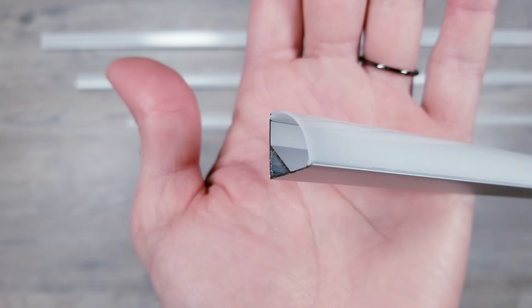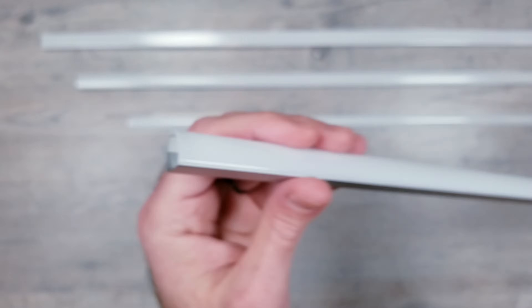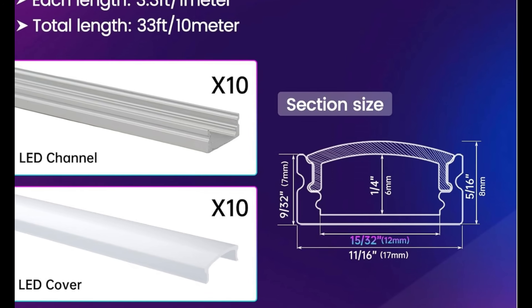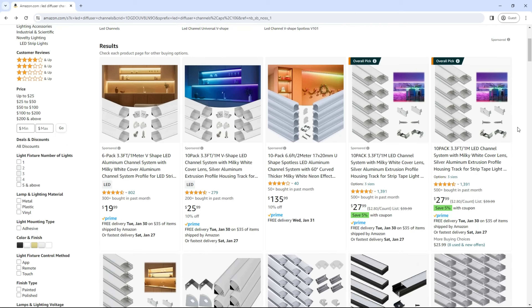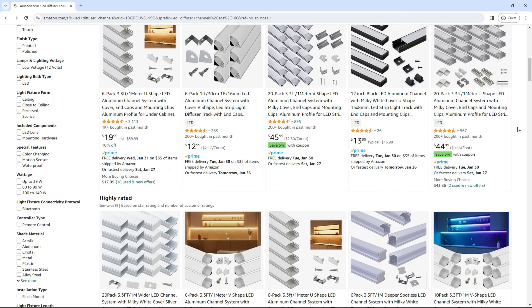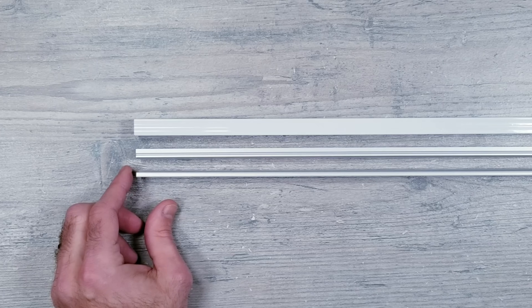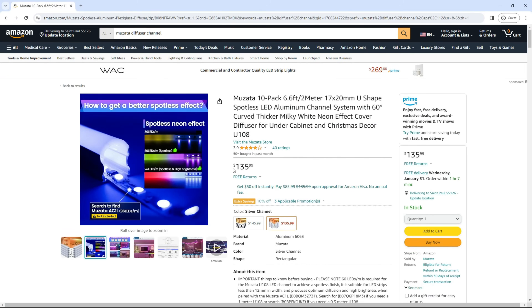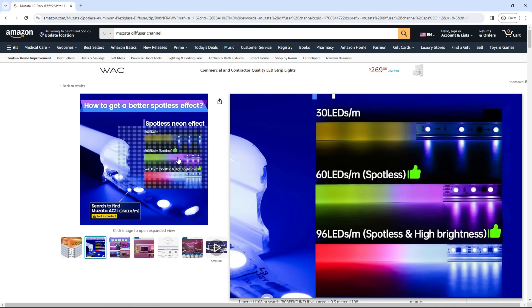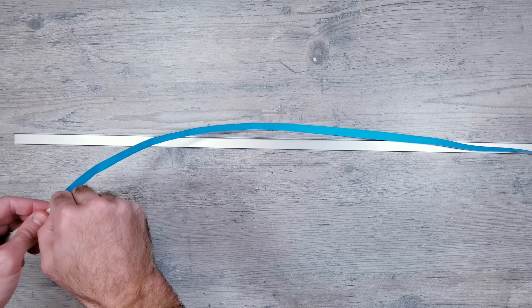You may be wondering why this is even something I care about, and it really boils down to three things. First, for many projects you want to blend things in as best as possible, and being able to use extremely shallow profiles helps with that. Next, the vast majority of channels out there are 12mm or less, so you'll have many more options if this works. And finally, it's all about cost — these are about half the price of a diffuser channel with zero hot spots when combined with a strip that has 60 LEDs per meter, and if you're doing a big project, the savings will add up fast.